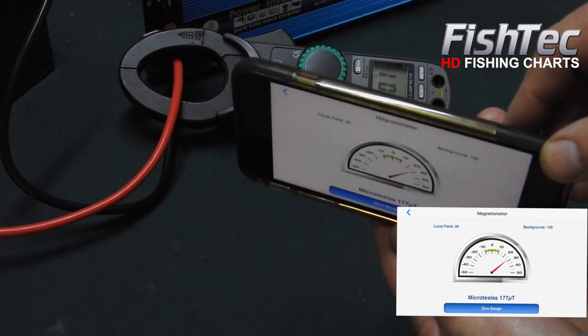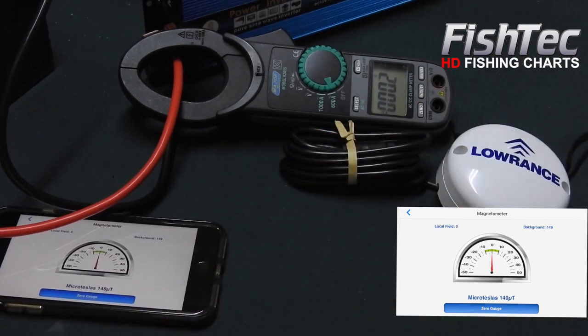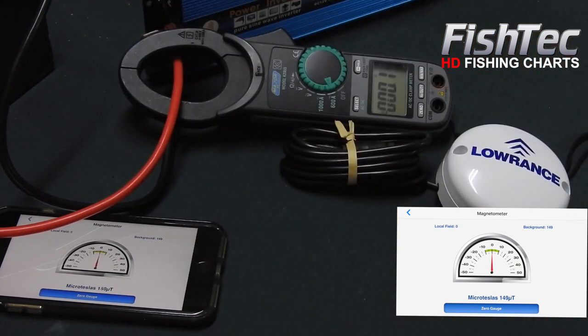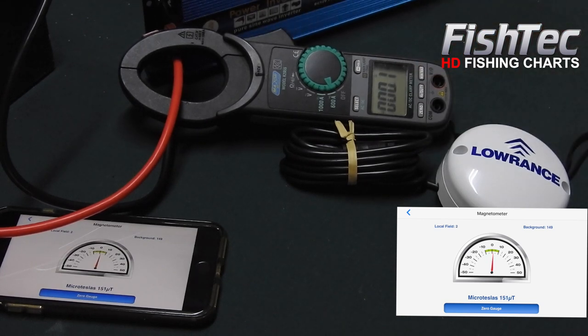You might think nobody's going to put their puck underneath wires, but these wires could be right underneath your actual deck with the puck sitting just on top. Watch what happens when I turn on some load — there's only 0.2 amps now. We turn that on and it jumps up to 0.6 amps. That's just the internal load of the inverter with no actual load yet. Now watch when I connect a small fan.